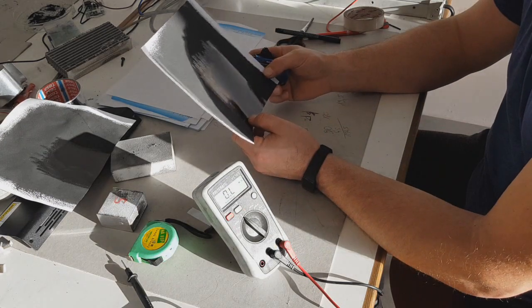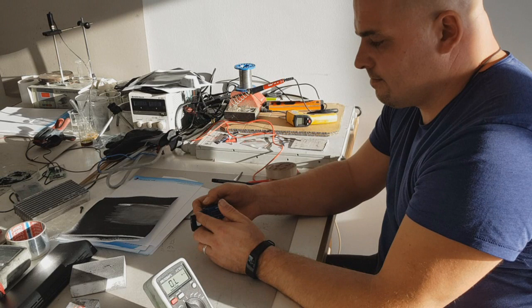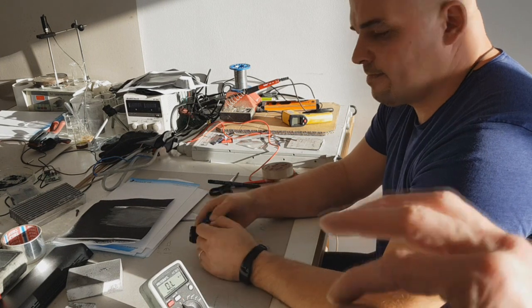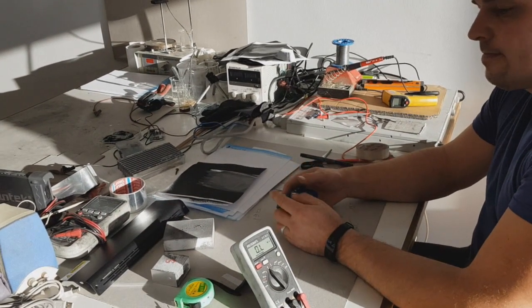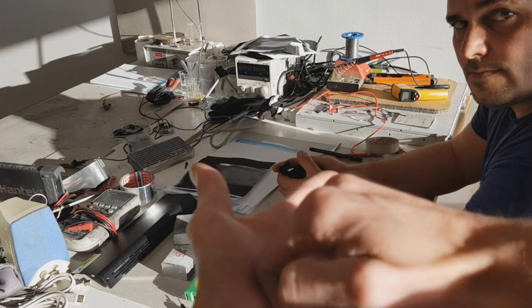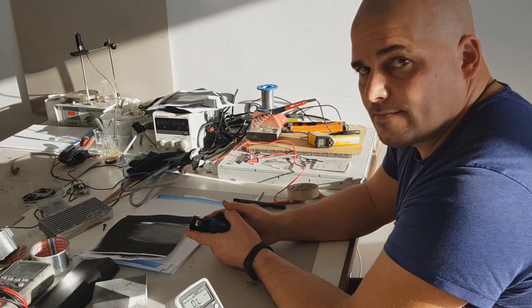It's really, really awesome. So guys, this was a little update on this conductive ink. To summarize: the more you press down this ink, the more conductive it will be and the thinner it becomes. We see that the paper has a thickness of 0.08 millimeters, and when we have the ink on the paper, it is the same thickness because we pressed the ink really, really hard. That's it for this update on conductive ink — see you in the next video, bye!